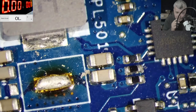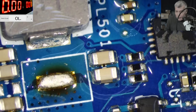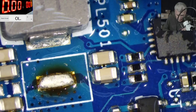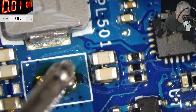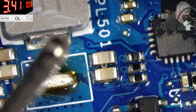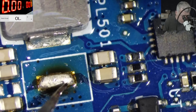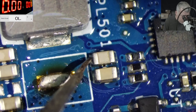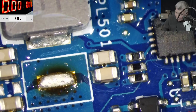Basically one of those capacitors is gone. Let me get the alcohol. This is unique — I swear it's unique. Alcohol there, and let's get the power supply. Ground here and plus here. Check there — it's that little one. The first one is gone. Check how many capacitors we have here — this is the output in parallel mode. You have one capacitor, a second capacitor, and three more — all in parallel mode.